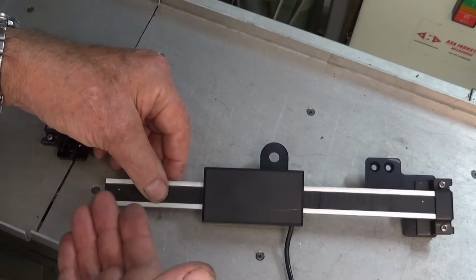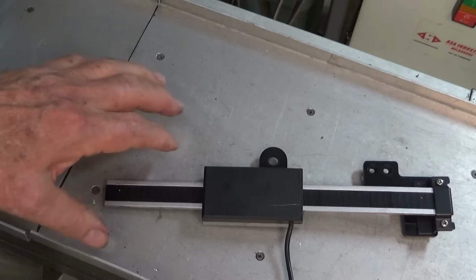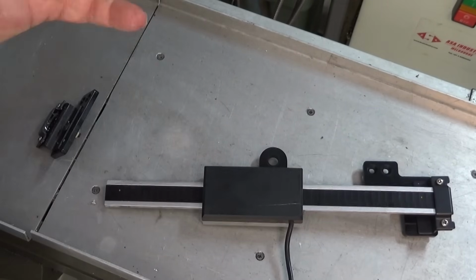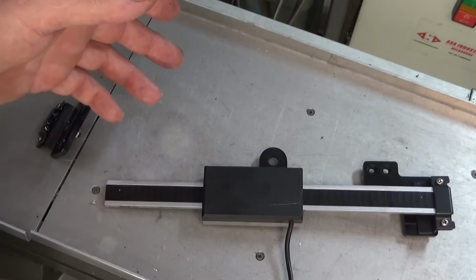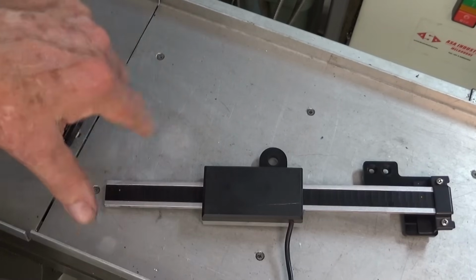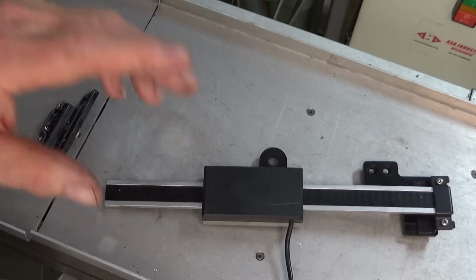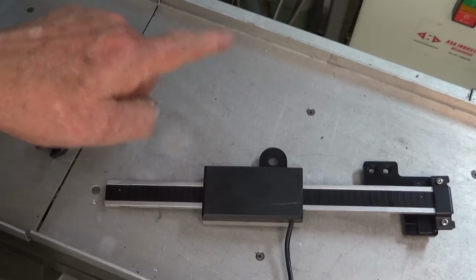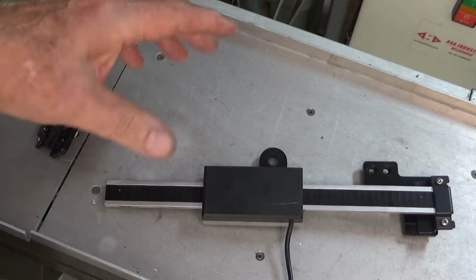So it seemed to tick a lot of boxes, and I fitted them up to the machine in like a day, and initially it worked. I didn't have a problem with it. But what I noticed was that it started to have issues when I turned the machine, the actual milling head, on or off. And I wrote to Yuri. Now, Yuri is the guy behind TouchDRO. He lives in the USA, and we had a conversation about the issues that I was having. He sent me a whole bunch of things to try, and I tried all of those. I thought I had fixed the problem when I found a loose connection in the electrical side of my milling machine motor, but I fixed that and the problem was still there.